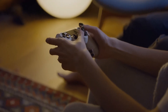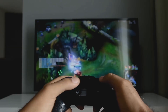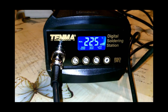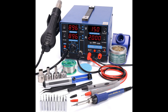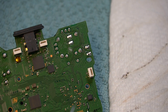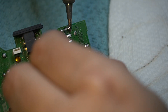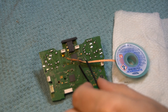Alright, enough backstory, enough preparation. Depending on whether you are replacing a PlayStation 4 or 5 controller, Xbox, Switch, or other controller, the procedure will be different on how to disassemble the controller and get to the PCB. Every soldering iron and tip is different, so you will need to adjust your iron until you get the right temperature. As a starting point, if you have a large chisel tip, set the temperature to 500°F or 260°C — just a little above the melting temperature of lead-free solder. If you have a medium tip, try a higher temperature: 600°F or 315°C. You should be able to touch the iron to the solder for a few seconds without it turning gross. If it turns black quickly, turn the temperature down. If it takes more than 3 or 4 seconds to melt, turn the iron up. First up, we need to replace the lead-free solder with leaded solder — we are going to flood each joint with solder, then use solder braid to remove as much of that solder as possible.